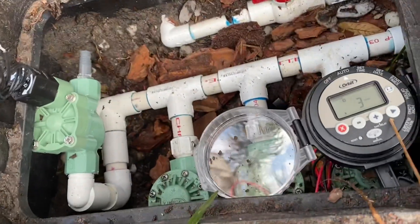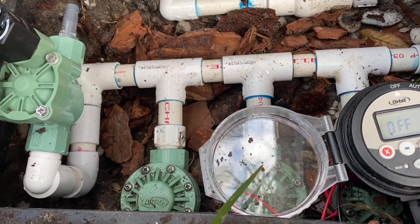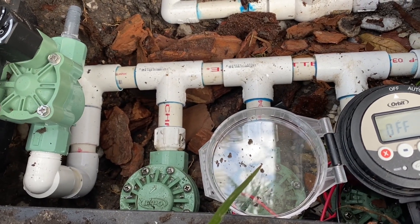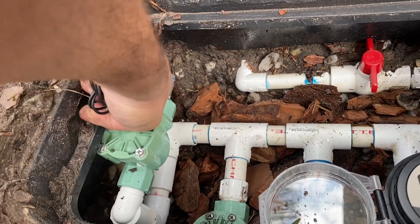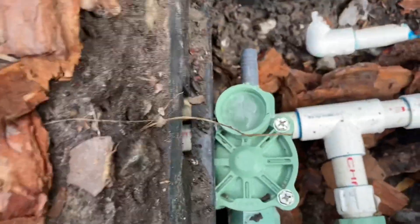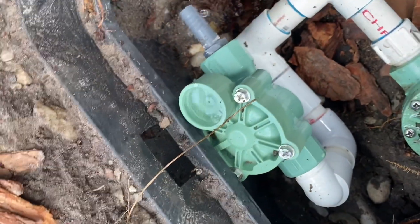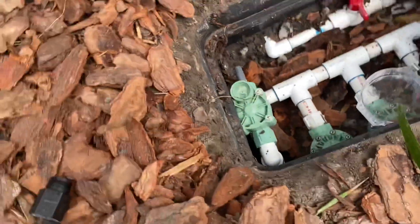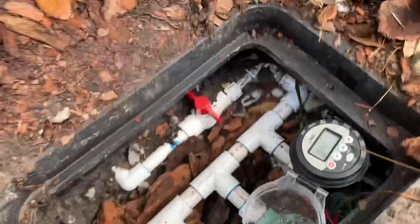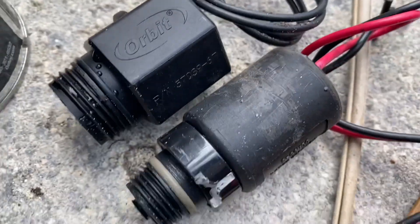But one thing to note though, like I said in the beginning of the video, is if you're going to run with this DC setup, you need to get — I'm going to post it down in the description below — there's a part number that basically acts as that on-off switch adapter for the newer style valves. The newer style valves have a big old wide opening. You can see actually here's a newer style right here. This is a new style — see how big that opening is? Here's the old valve. No way in hell that's going to thread in there. Let me compare the two. So this is what we installed in the old valve — the little adapter and this. And look at how big those threads are. You definitely need to get that adapter.